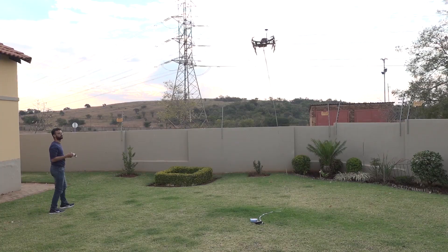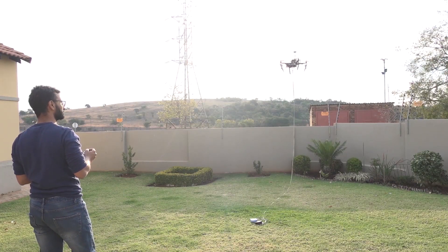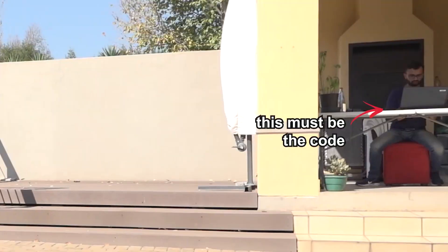This is not what it looks like in the video — it sort of looks like I've got the drone to follow me, but naive younger me soon realized the drone was turning on its own, drifting, and I just happened to be in the same field of view of the drone's camera at the time. It was purely coincidental. After a series of tests and flights I managed to figure out why this was happening — it essentially came down to recalibrating the drone's compass. I was racking my brains thinking something was wrong with my code. It worked anyway.